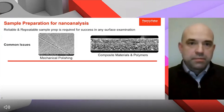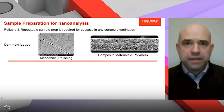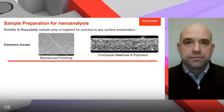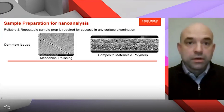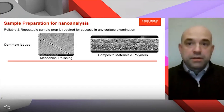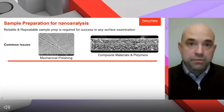Some of the common issues we run into — probably all of you have experienced this — is that standard prep for a lot of microscopy involves mechanical polishing. Especially if you have soft surfaces or metals, like we have here in the left image, mechanical polishing leaves a lot of potential issues and artifacts that obscure the features of interest and make reliable inspection of defects or morphological measurements difficult. For soft or composite materials, often the only way to prepare them is by cutting with knives or scissors, which leaves the surface poorly prepped and prone to plucking and other issues.